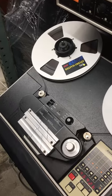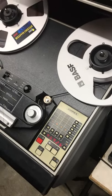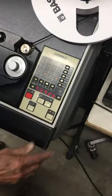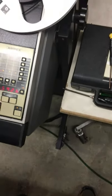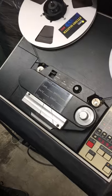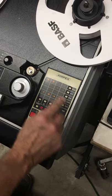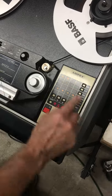I should show how to record. We're going to use my signal generator here. I'm generating one kilohertz, plus four. So we're going to load the tape — the XLR feeds are in. We take up the tape, I hold this and just flick that. How do we arm it? We go like this — got to push that down, this little matrix. Track one, track two — that means they're ready. This is safe — that takes them out of record. It hasn't been pushed in a while, so they need a little exercise. Now we're ready to record.